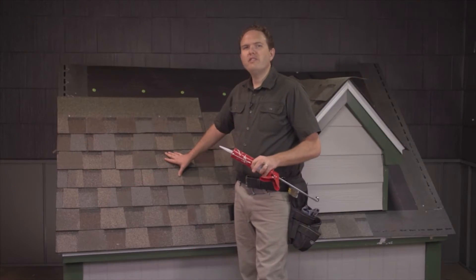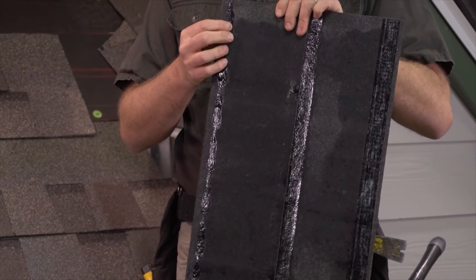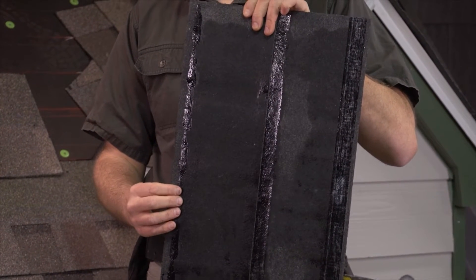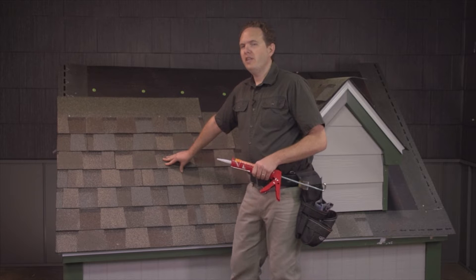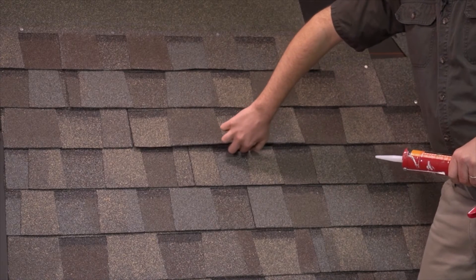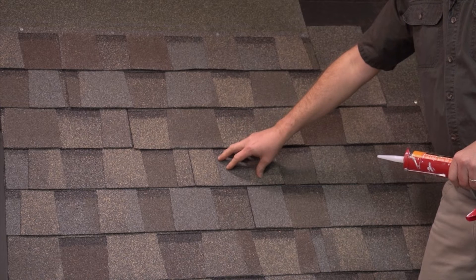When you're done replacing the shingles, you'll want to apply some sealant to help the shingles glue back down. On this architectural shingle, you'll notice that the glue strip is located here on the bottom at the very lower edge. That means the old shingle above will need to be glued down to the new shingle to activate the glue. The shingle we replaced has its glue strip at the bottom, so when it heats up, it's going to glue back down fine to the shingle below.